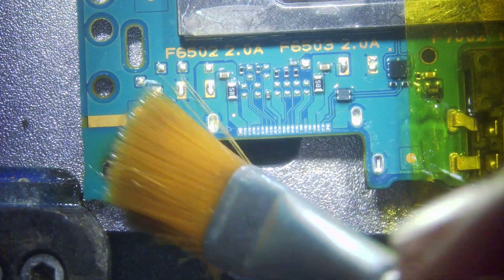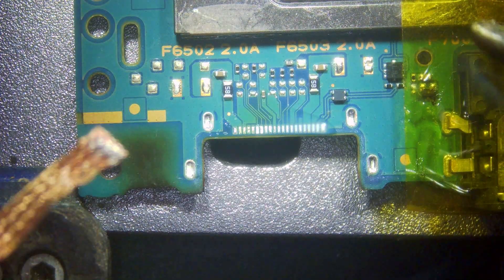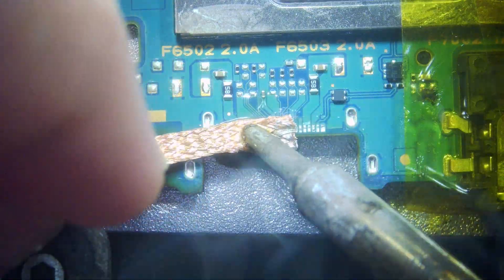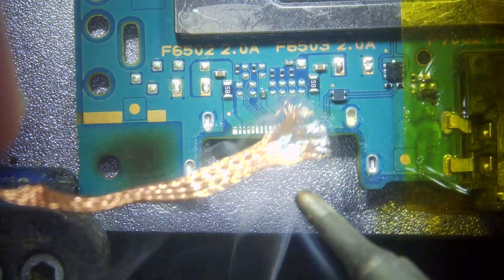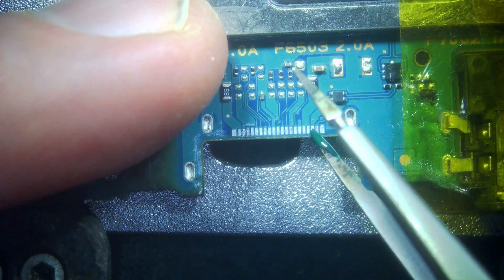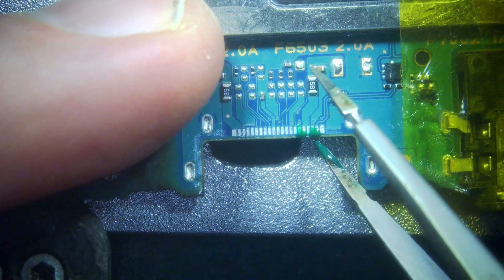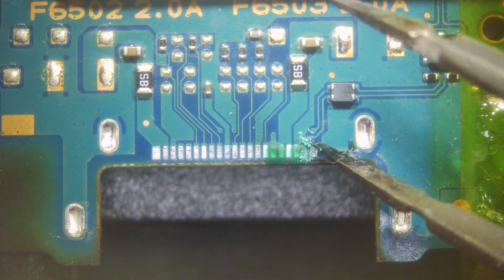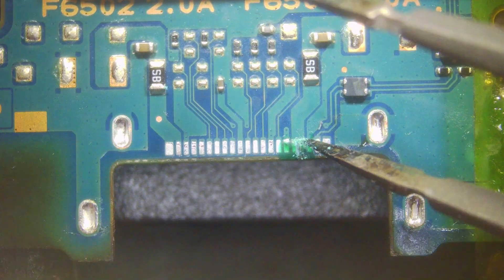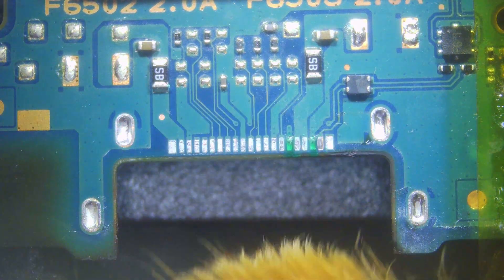Once it's cooled we clean with isopropyl to make it all nice and fresh. I apply a little bit more flux, then get the solder wick and remove as much solder from the pads as possible — the extra solder isn't needed. We give it another clean. Now we apply solder mask to pin three and pin six. It's quite fiddly, but I put it on, hit it with a UV light to cure it for a few minutes, then come back with tweezers and scratch off the parts that shouldn't be protected. As you can see, pin number three and pin number six are now completely covered.